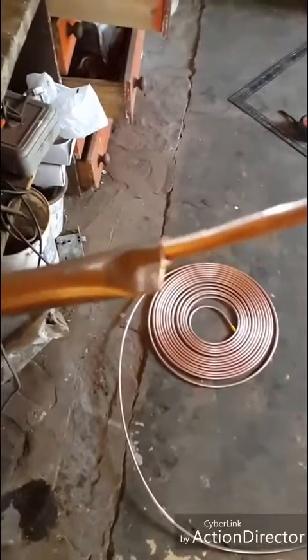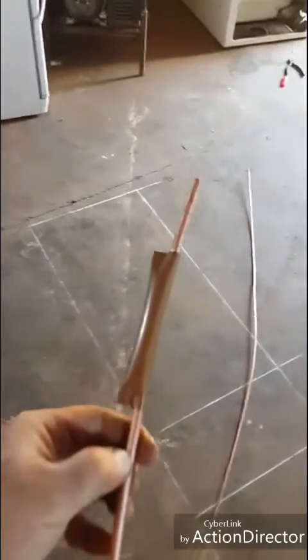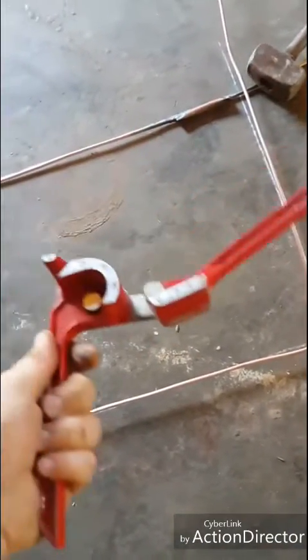This is going to come out towards where the compressor would be. What I did was I just took a pair of pliers and squashed it around the corners — just with a piece of copper pipe that goes through it. So I'm just going to yank it out to one side and weld it in. I've got the accumulation chamber on here as you can see, so that is done. We want to try and stay inside the lines. The copper has a little bit of stretch so I've found it starts waving out if you make it too long — make it a little bit shorter. 90 degree bends. I use this cheap pipe bender; the copper isn't hard, but you want to bend it with a bender — it just looks much neater. And we want to do that all the way — 30 meters.